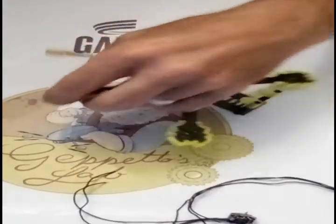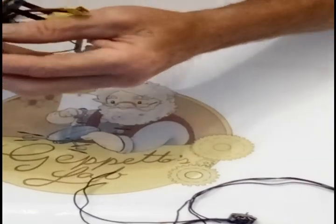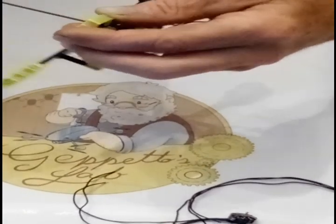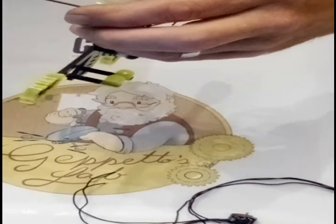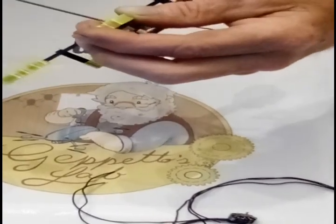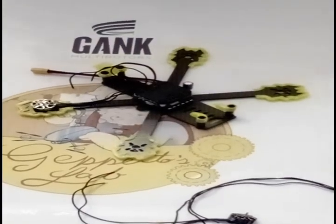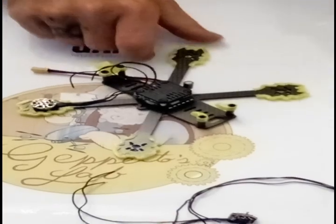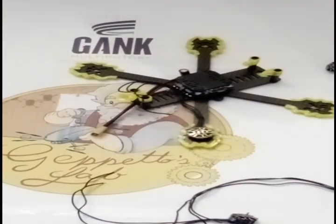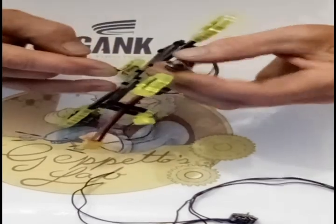You know, I come from flying helicopters and never, unless you know what you're doing and using the appropriate stuff, over tighten or use Loctite on aluminum. Again, I'm not saying don't do it, but you're not wanting to smear all those threads with Loctite. It's the last one or two threads is more than enough. You'll find real quick that if you just soak this thing in Loctite and screw it on up in there, if you ever have to try to replace it, you're going to be in a world of hurt.